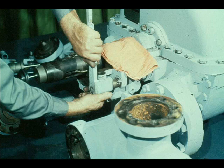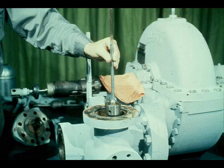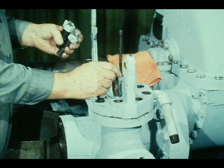The next task is to replace the hand trip lever and torsion spring. Then reinstall the snap retainer ring. The overspeed trip valve is placed in the valve body as shown. Make sure it is properly seated in the valve seat. Don't forget to apply the proper sealant to the joint between the valve body and the cover. After the sealant has been evenly applied, install the cover and secure it.